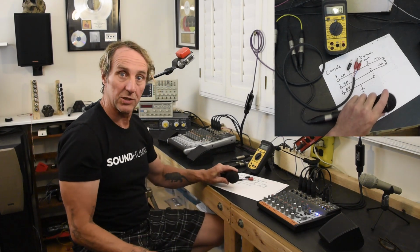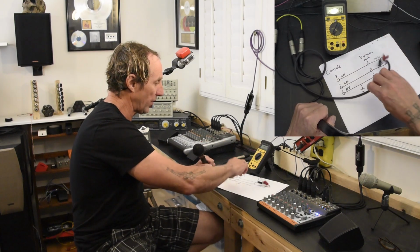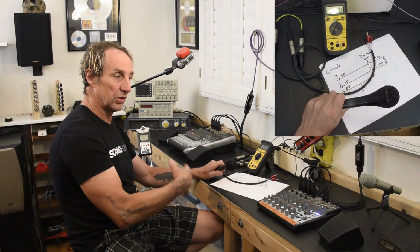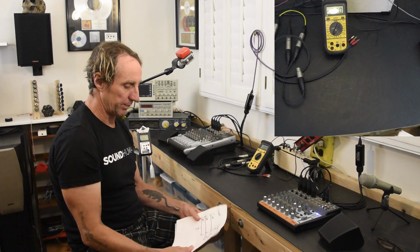All right, I don't recommend doing that to microphones, as it can damage them, especially delicate mics like a Sennheiser 441 with a really delicate coil, or ribbon mics, it can destroy them. It'll blow that ribbon into pieces. So it's not generally a good idea to put phantom power onto dynamic mics, but phantom power is designed such that in a properly wired system in good condition with nothing wrong with it, there is no negative effect directly from phantom power. Again, having phantom power on a dynamic mic, if the cable is slightly crackly, you'll hear that voltage. It can cause issues. So I don't recommend it, but if everything's working right, it won't hurt the mic. All right, so enough on powering dynamic mics with phantom power.